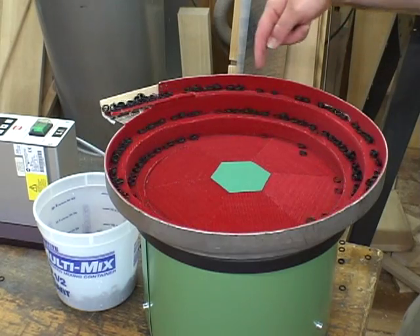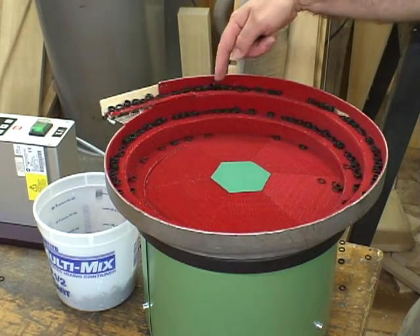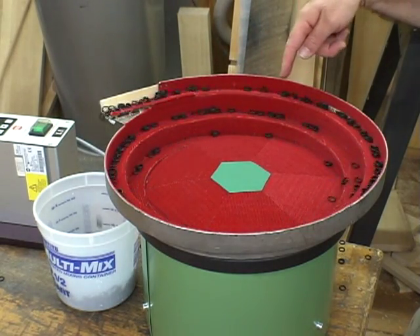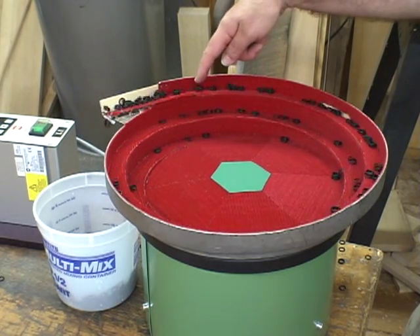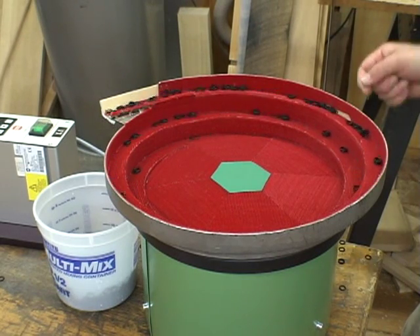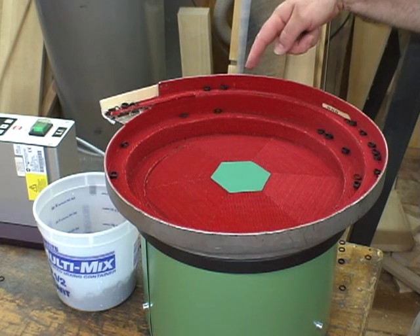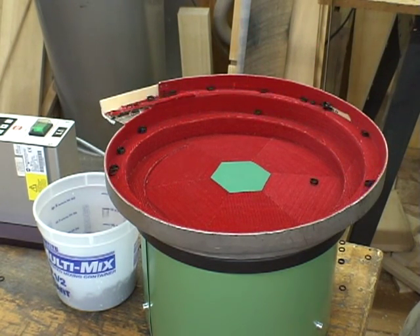There was a piece of track over here that I had taken out because the parts that they were feeding were much smaller in diameter. And so the velvet or velour or brush, or whatever you want to call it, in this region has been crushed and it is permanently deformed. But the rest of the bowl is in pretty good shape, so we either live with that section the way it is or we try and find this velour from the manufacturer.